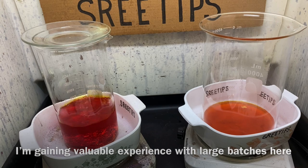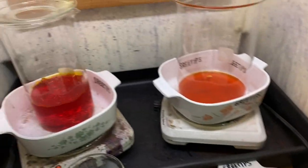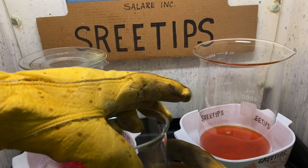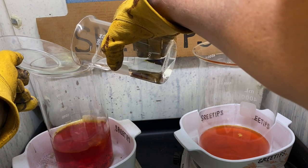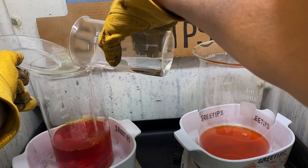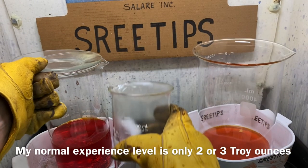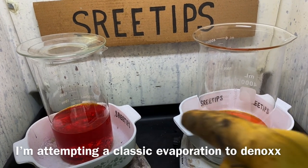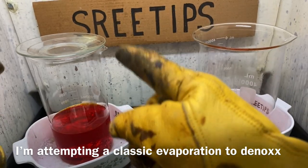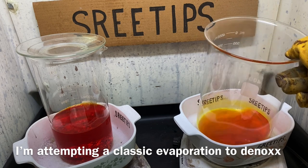This has been boiling now for about an hour and a half. I've added most of the gold to that now — that's all I've got left. I'm going to check this — I've got some hydrochloric acid here, about 125 milliliters. I'll pour it in here and make sure we don't get a foaming reaction. What I'm trying to do is make sure I've used up all of the available nitric in this reaction. I poured 200 milliliters in earlier and I've just been letting it boil. Once I get this solution boiling and there's no fumes being produced, I'm going to transfer the solution into this beaker that I'm heating up here and evaporate this down to a syrup.